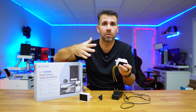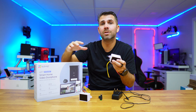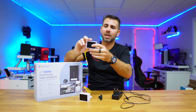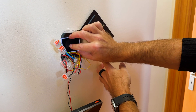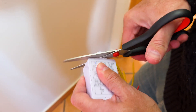If you have difficulty identifying these cables, I would honestly suggest hiring an electrician or asking one to advise you. Once we have identified all the cables, we just need to first switch the power down and make sure there is no power so we can work safely. In this particular case I placed the power adapter in the derivation box — it's not that big, so I ended up breaking the small handles on the sides to fit it better.